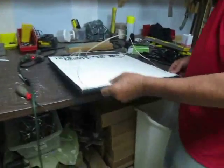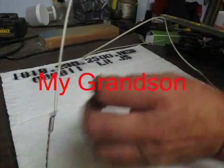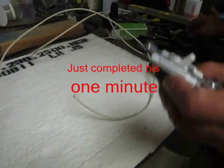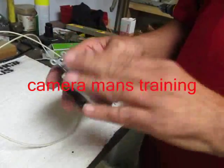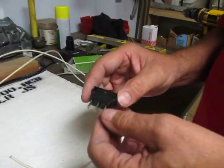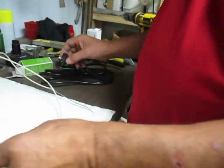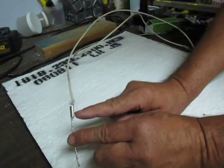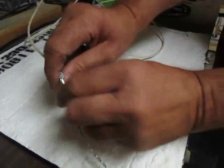When you take your flash dryer apart, this is what you're going to see. You're going to see a twisted wire connected to a heavier insulated wire. What goes out in a flash dryer is either the switch, or this wire right here heats up after a long time — a couple years or a year or whatever use — and it melts the insulation. So it separates.